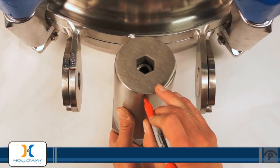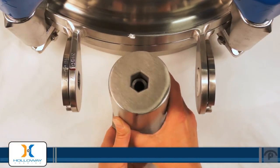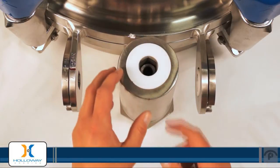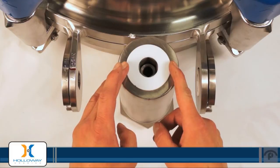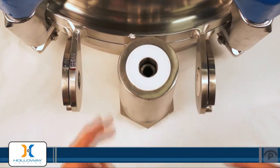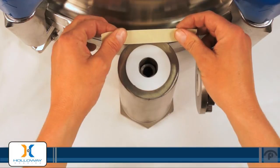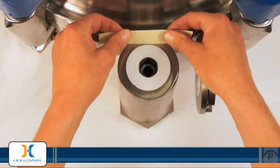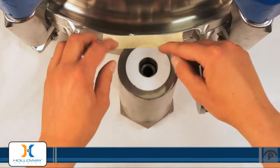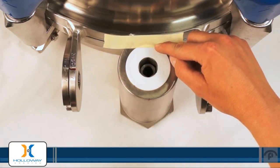This will assist later on with the inner hex bar engaging the left side hinge. Install a washer with a large diameter hole on the end of your barrel, making sure that the hex hole is clear. Another helpful tip is to use a piece of masking tape to help hold that washer on the end of your barrel during assembly. You don't want to put the tape on extremely tight — just catch the edge of your washer with the tape, because later on we're going to pull the tape off after we have the spring assist installed.